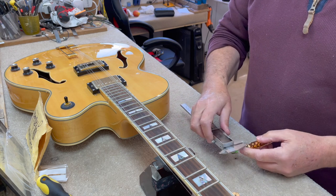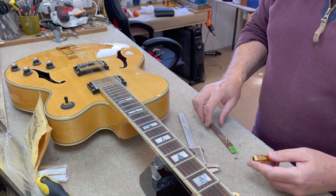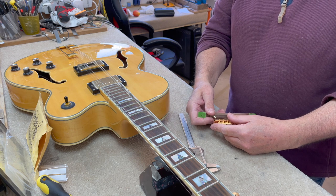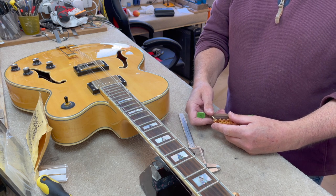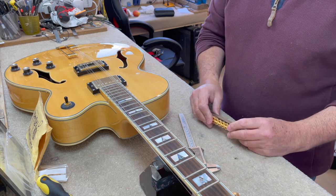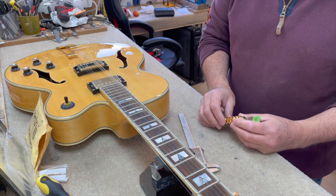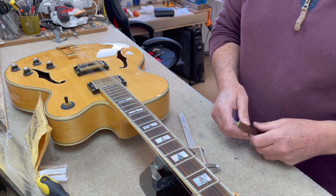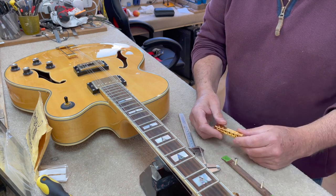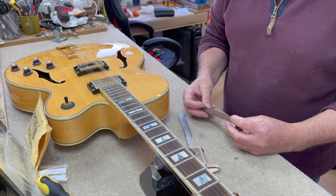The alternative is we take 4.25 off the metal bridge structure, which, as you can gather, is going to be a lot harder to do. So realistically, you can take the thumb wheels off and we don't gain much actually because of the curved underside. So let's not remove the thumb wheels, because we want to retain some up and down movement. So 4.25 is what we need to remove. That's going to be this piece here taken down.